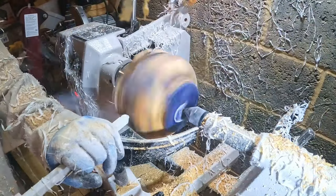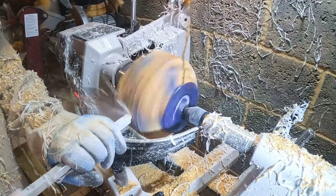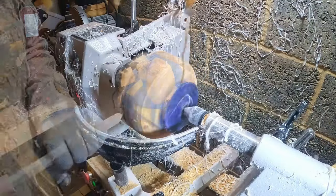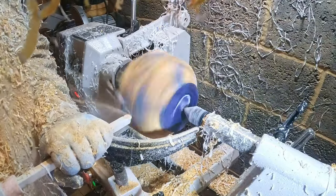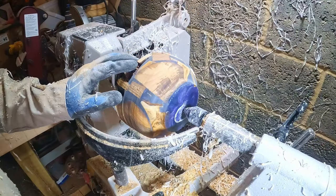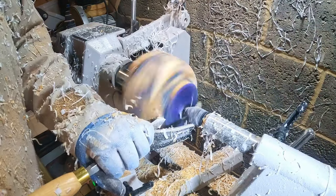I had been leaning towards forming a pedestal, but whilst removing the chipping a form started to appear — a bowl with a curving side set on a raised foot. I continued removing material until I was through the chipping, stopping to re-center the blank on the tailstock. Once through the chipping and the thin patches of resin had gone, I squared up the foot with a quarter-inch parting tool, and whilst I was at it I removed material from the underside to flatten it off.